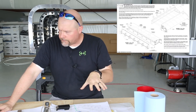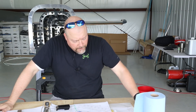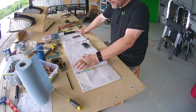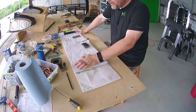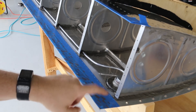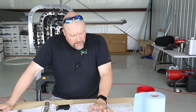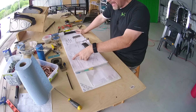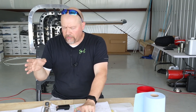So this is page 18-8 where we talk about putting the ProSeal on the back baffle and closing it up. It says: apply sealant to the T1001 left fuel tank skin from the tank baffle rivet holes forward. Upon installation of the tank baffle, it acts as a squeegee and a bead of sealant will be pushed ahead as the baffle is moved forward. This means I need to put a good amount of ProSeal on there to get that squeegee bead to happen.